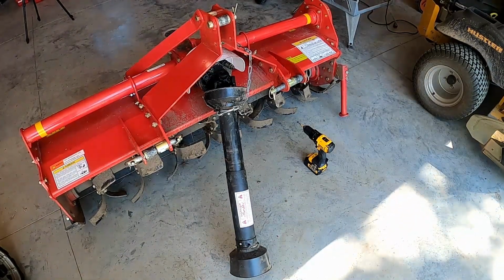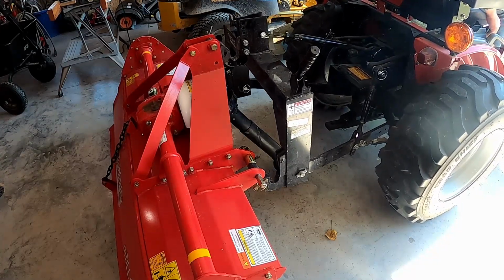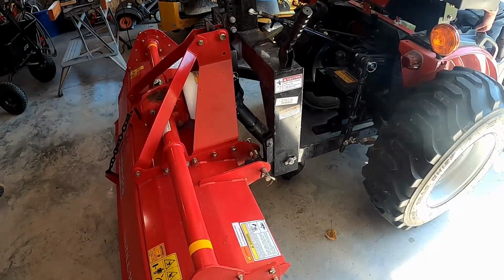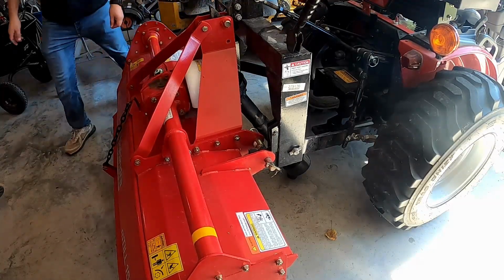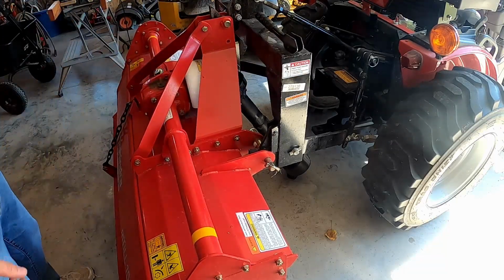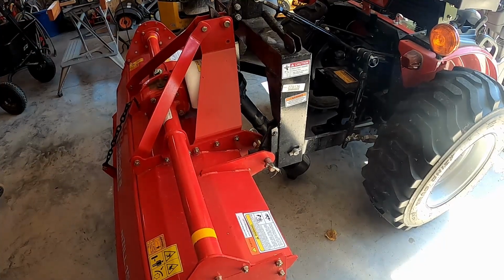So let's go ahead and hook the tractor up to the implement, and then we'll start doing some tilling. This side is already locked down, but when you're done, you just go across like that. It's kind of loud. You can let it down nicely. I wouldn't do that. But they are spring-loaded hooks on here. So that's how easy it is to hook up to the 3-point itself.